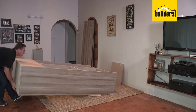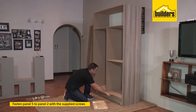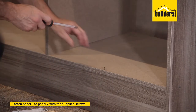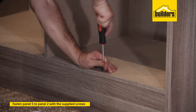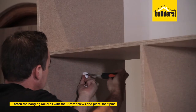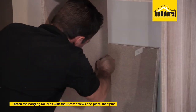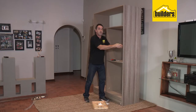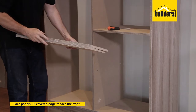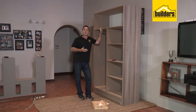Gently slide it forward and lift it up into its upright position. Now that the unit is upright, pop in the two screws to secure the front rail section. Next, pop in the rail holders — there are holes already pre-drilled on either side. Then pop in the shelf pins into the pre-drilled holes to accommodate the two floating shelves, panel number 10. Make sure you keep the covered edge on the front side.